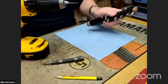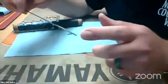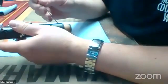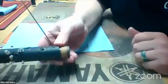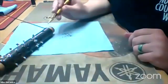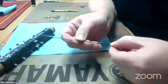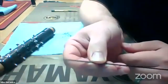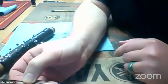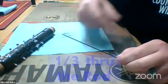I usually do two or three passes on this. I got my carbon fiber rod — I like to have a nice smooth surface, so I just stick it in my lathe real quick and sand the end of it, the part that's going to go in. I'm going to put that in the hole I just drilled. I got it sticking right out there. I'm going to draw right where the pin meets the hole so I've got a mark. I need that mark because I need to cut a little slot there so that when I fully install the pin and glue it in, I can break it off right at the correct spot. To put the slot in there, I need to take it back to my lathe and I'm going to aim for sawing in about one third of the way through the rod.